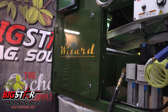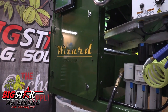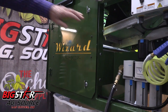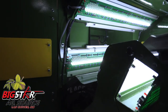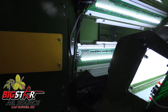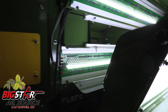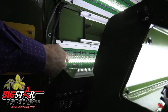The primary components of the sorter that provide the effective removal of stick tights, sticks, and other unwanted debris are the LED light bars and the high pressure air valves. The system requires high intensity dual spectrum lighting to allow the camera and the computer to accurately identify which objects are good pecans and which need to be rejected.